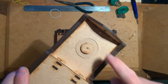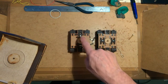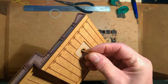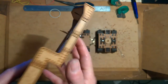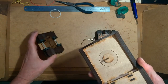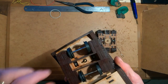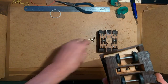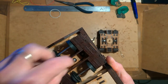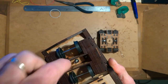Right. On the back you can see there's the disc that we were talking about before that the actual bearings will run on. So to assemble it we add a bolt through the back, put your finger on it and hold it tight. Take a bogie, doesn't matter which one, and drop him down onto the bearing. So the bolt comes through. Then add the spring, which more or less should line up with the bottom of the bolt, so you can just get the nut on.